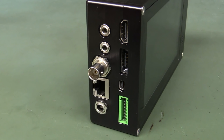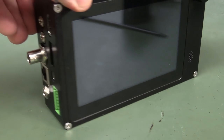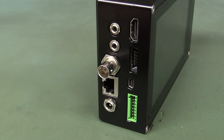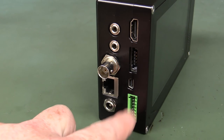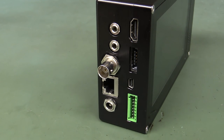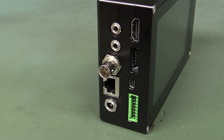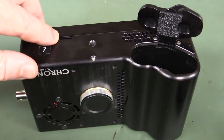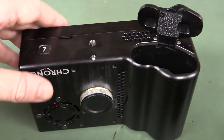There's external power — you can actually run the camera from the external 40-watt power input, which is fantastic for dedicated lab setups and measurements where you don't want to be messing around with an external battery. External full-resolution HDMI to hook up to an external monitor, as if the built-in 5-inch wasn't good enough. External USB, eSATA, USB Mini-B, as well as standard Phoenix contact for external trigger and isolated external trigger. And two 1-meg sample per second ADC inputs — why not? A micro SD card slot for firmware updates too.